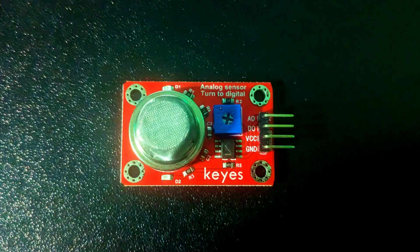The sensor has four pins: ground, VCC, D0, and A0. It provides two different inputs — analog and digital. The A0 analog pin's output voltage varies in proportion to the concentration of smoke or gas. The higher the concentration, the higher the output voltage. The analog signal is digitized and outputs a binary value with the D0 pin.